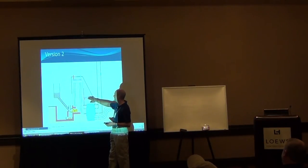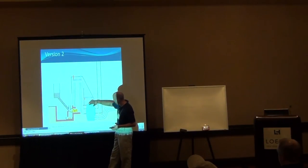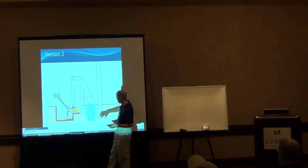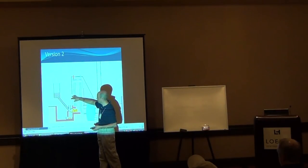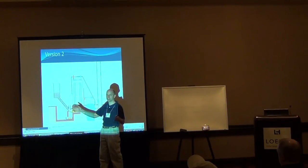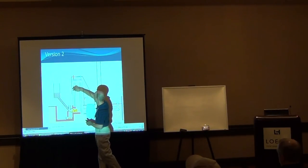And then a second one here. So as this fan over the barrel is blowing and pulling down that hot air underneath the floor, the fresh air from the building is coming through in here. And this isn't exhaust air. This is just standard air that's coming through the building. So that's coming around the barrel.